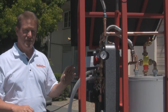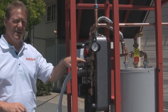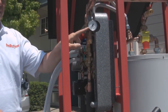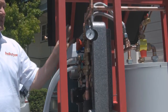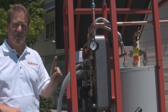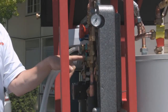I'll talk through the process first. When I open the lower valve, I should already have the upper valve open, which means I have basically no pressure in my system — any water that goes in can escape through the upper valve. As soon as I close the upper valve, we'll see the pressure gauge go from 0 psi up to about 85 psi. At this point we've put together all our piping but don't yet know if we have any leaks. We're going to do two things in rapid succession: first flush all the debris out of the system, then close the exit valve to build pressure, and immediately close the supply valve.